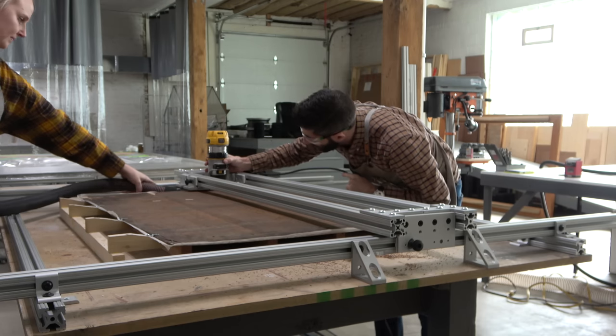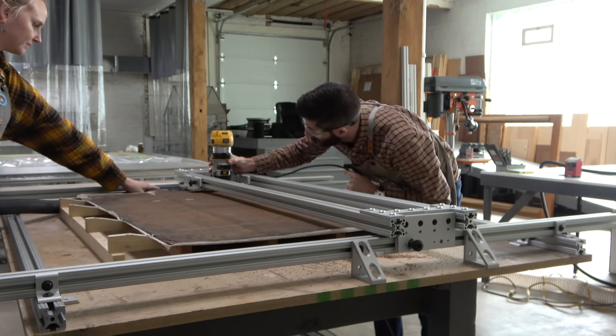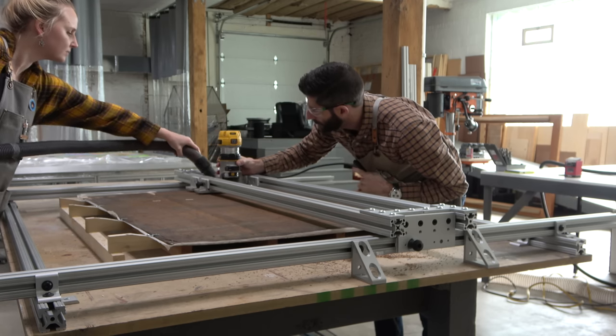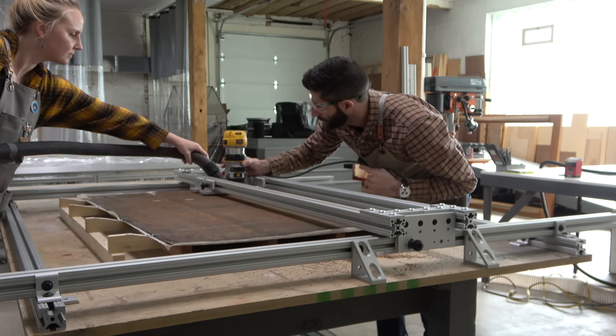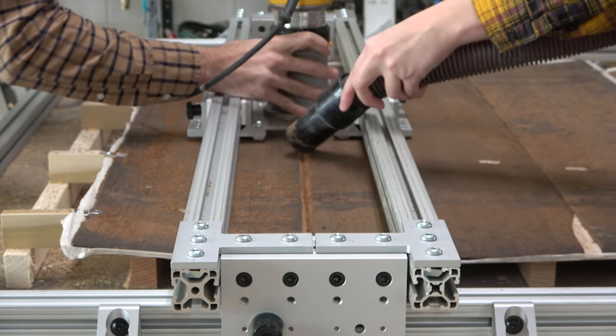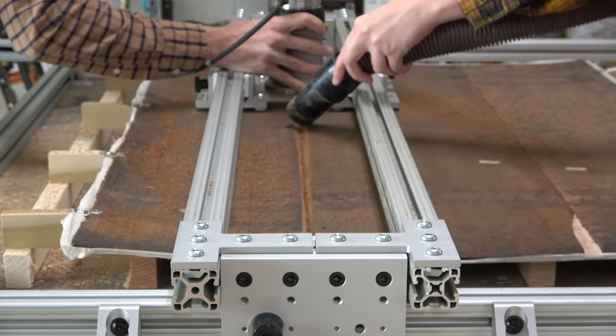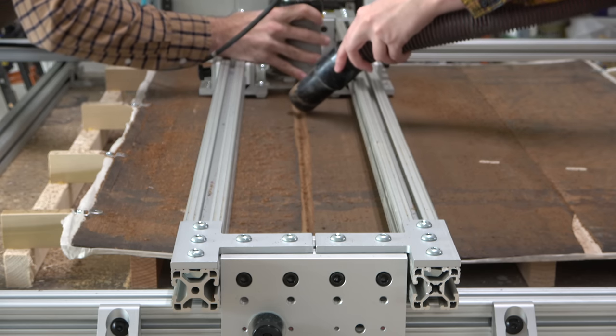On the second pass we can start moving down and removing a little bit more material, but even still I'm removing barely a 32nd of an inch — and that's by design. There's no benefit to going fast. We can take as many passes as we want and check along the way to see if everything is going according to plan. Thus far everything looks great — all of our preparations and practice have led us to this moment where we feel really confident. We'll make several passes — 3, 4, 5, 6, 7, 8, 9, 10 — however many it takes to get the groove where we want it.